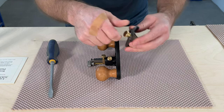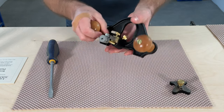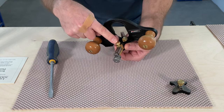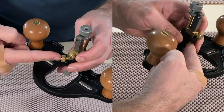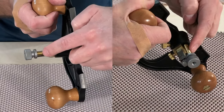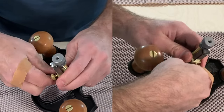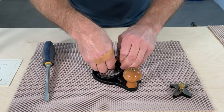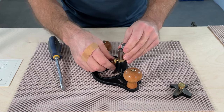The knobs are all brass. You've also got brass knobs for the depth stop, as well as to lock the blade into the tool, and the threads here are also brass. The blade, per the website, is A2 hardened to a Rockwell hardness of 60 to 62, and the remainder of the parts are stainless steel.